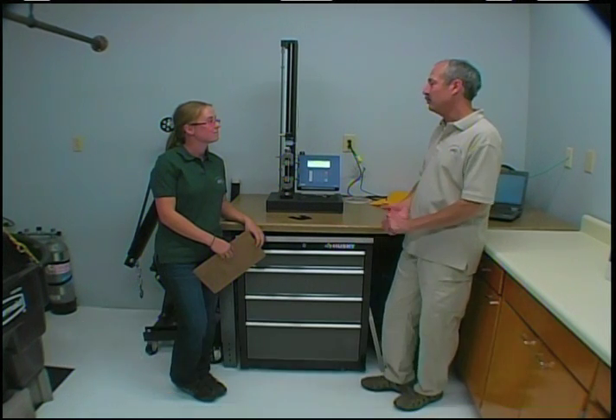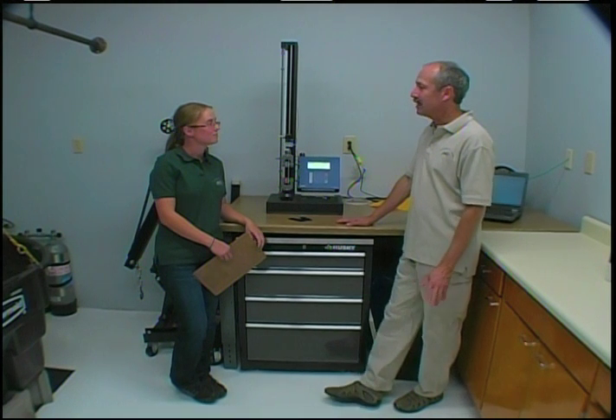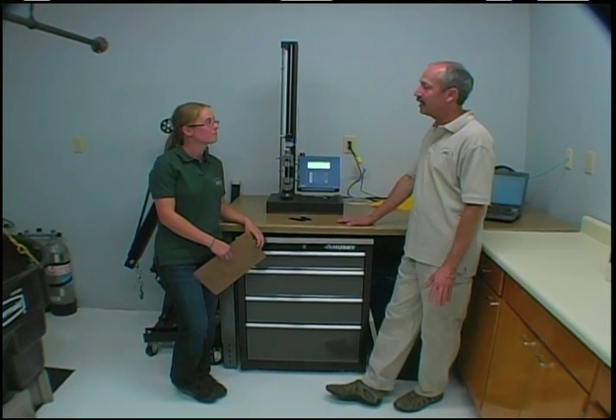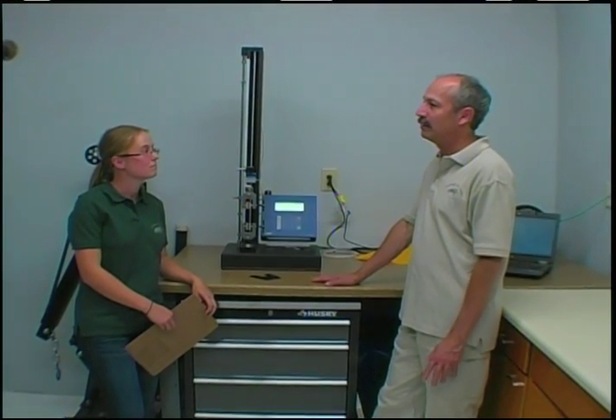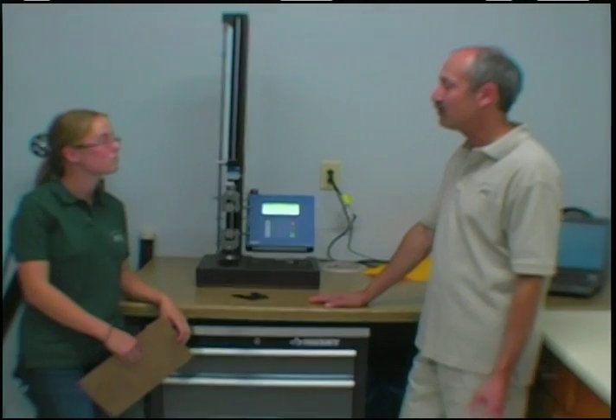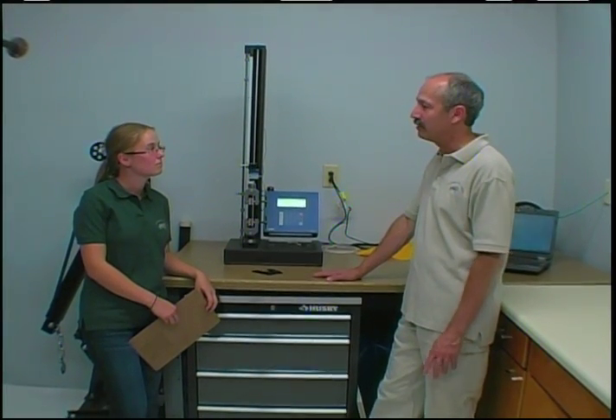Well, Danny, we can run quite a few different tests here. We can do seam strength tests, tensile tests, various types of buoyancy tests, short and long-term air retention tests. We can do pneumatic as well as hydrostatic pressure tests on flexible vessels, and we can even take those to destruction if we need to.